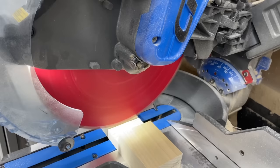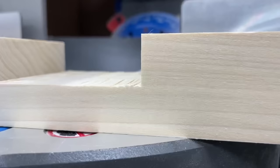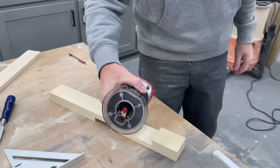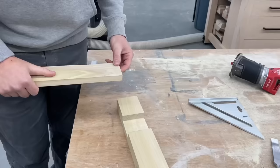What I'm doing here is moving the material sideways to flatten the bottom. Even though I completely cleared all the material away, the bottom isn't totally flat because of the alternate tooth bevel on the blade. So you can either do that to take those grooves out, use the chisel, or really if you're doing something where the backside isn't visible, as long as your piece fits flush on the outside where it matters you could just leave it as is. Or a third really great option to flatten the bottom after using a circular saw or miter saw would be with a mortising bit in the router, but I'll show that later.